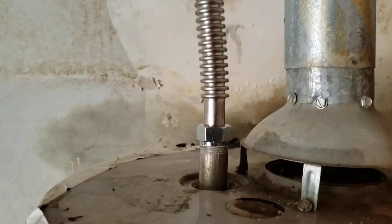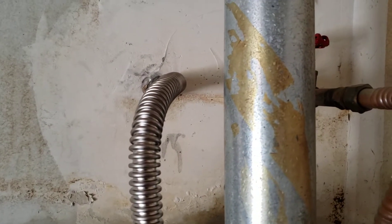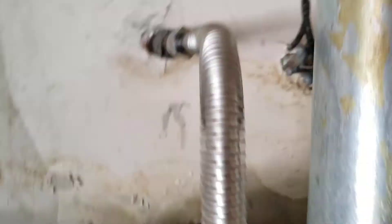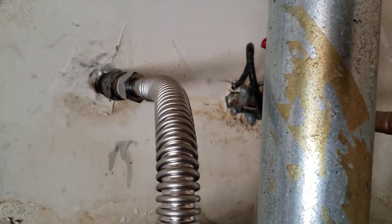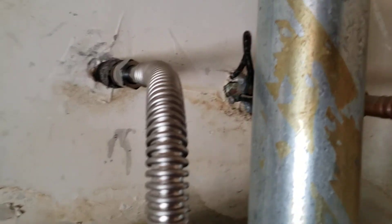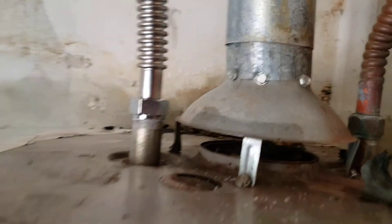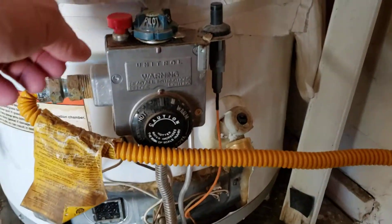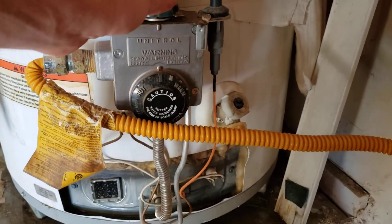The sheetrock should dry out pretty well. We got a new connector installed — these are Falcon stainless steel connectors, full three-quarter inch inside diameter, tied right back into the tank on the hot side. As quoted over the phone, it's just a mechanical joint, so $125 for that replacement. The homeowner had shut the gas off to the water heater, and we relit it for them.